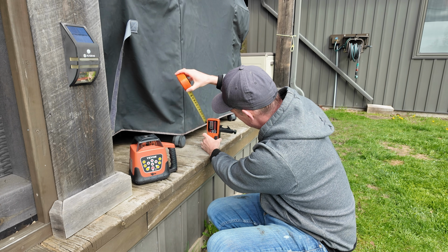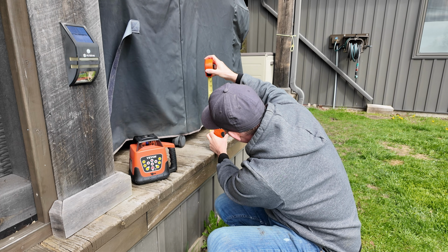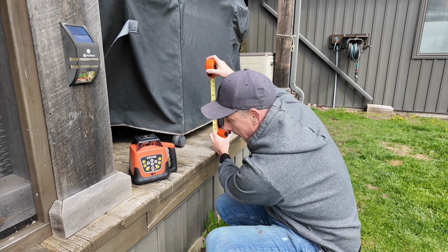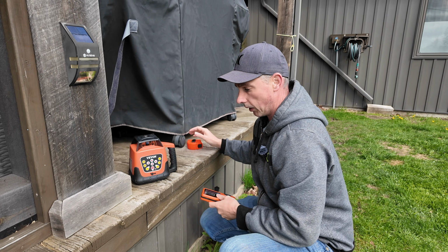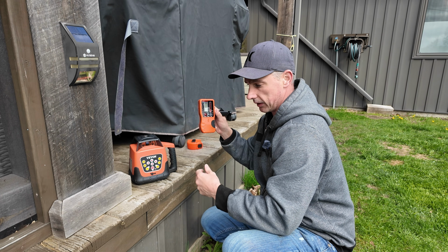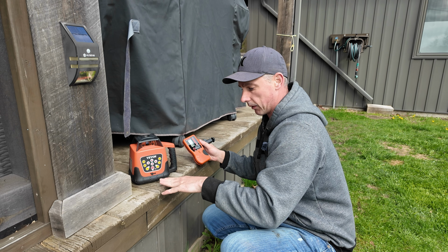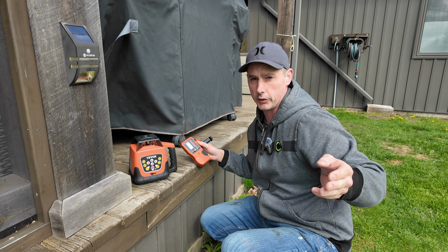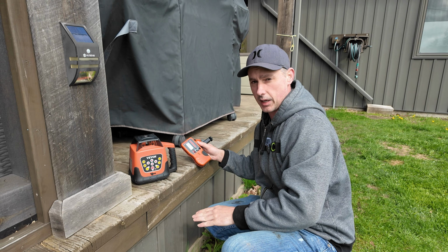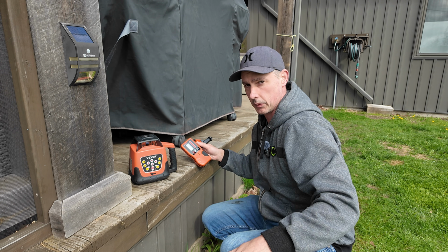Okay, it's saying down. Now I'm just gonna put my measuring tape beside it. Oh, now it's saying down. So right there, I'm about 6 1/8. So I need to take that measurement into account when I do my actual stick to mount this. I need to measure down 6 1/8, and then that way I get to my 0 level. And then from there moving forward, I'm gonna do my deductions for my 7-inch step, and then my 50 3/4 inches for the pool cap to the base.